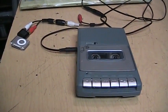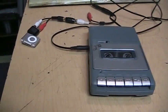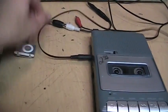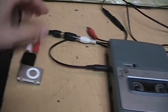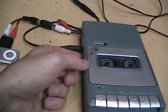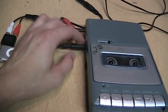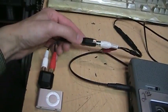Now, obviously this is not meant for recording music, but I wanted to try doing it anyway. So I used my little iPod here and an attenuation cable and this adapter to convert the iPod stereo output to a mono input. Because although the headphone output is stereo, the microphone input is not combining the left and right — it's only one channel, so you have to combine it externally. We'll see how that sounds.